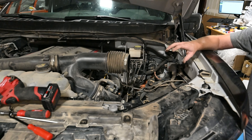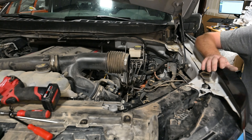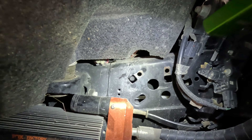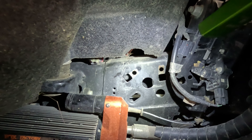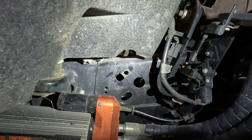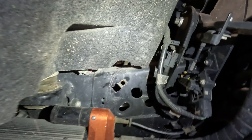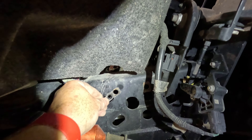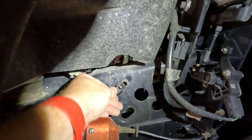So the way this goes, there's a little nipple here and you thread this together. I'll show you how it goes and then I'll pipe thread seal it all. This goes on the compressor, making enough room for that 90 to turn. Then the hose goes on here — there's one end that's a swivel, one's not. I usually put the swivel on this end on the elbow, but that doesn't much matter.